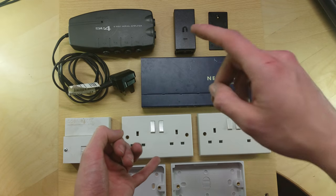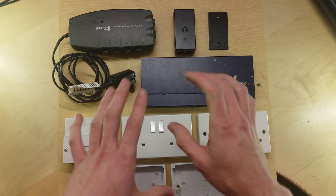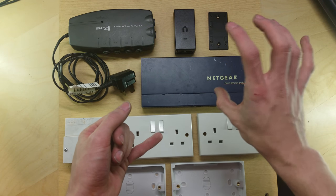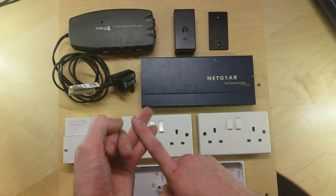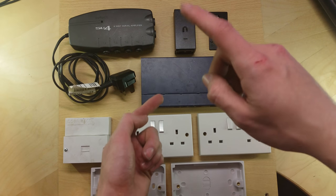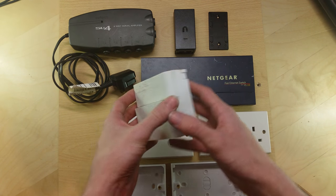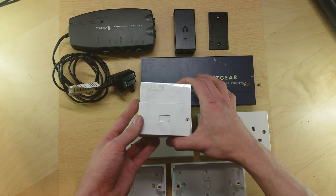It's going to connect a few TVs together and some hardwired ethernet lines. Basically it's a cupboard in the centre of the house where everything is coming into. We've got a link out to a Nanobeam dish on the exterior of the house connecting to the internet remotely from another building. We've got the TV aerial coming in as well, which is a single line split to three TVs using a four-way aerial box. We've also got a BT landline telephone connection coming in, which needs to be terminated here — even though it's not going to be used, we'll be terminating it for future use if a package is required.